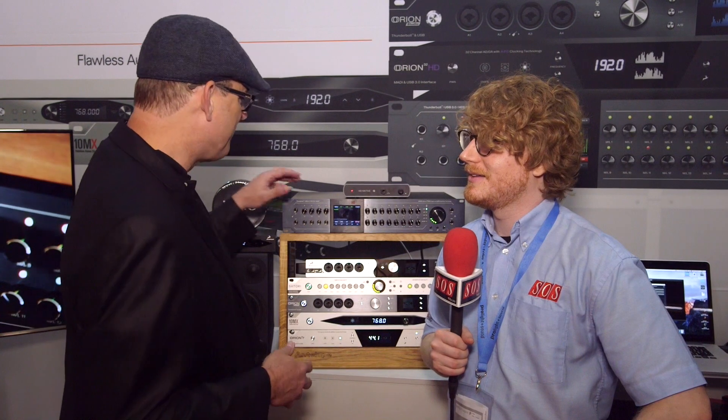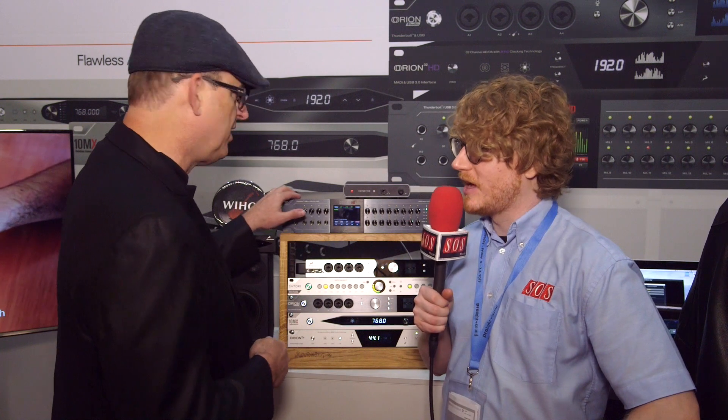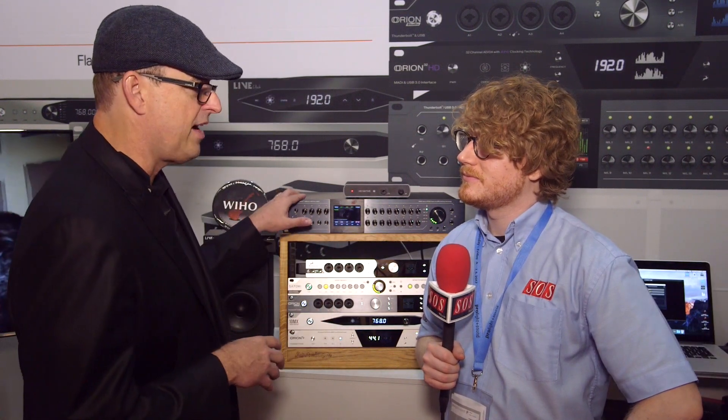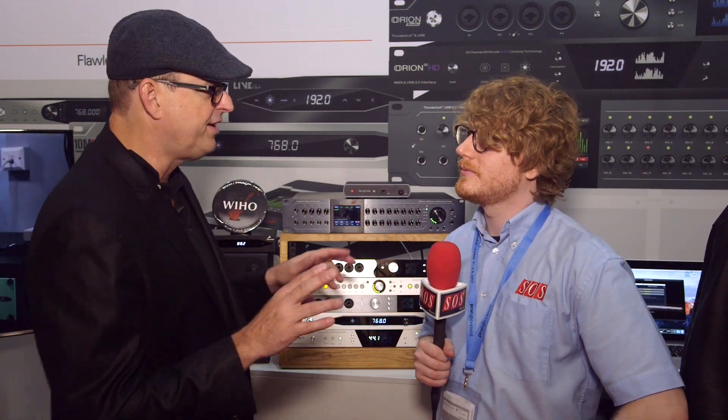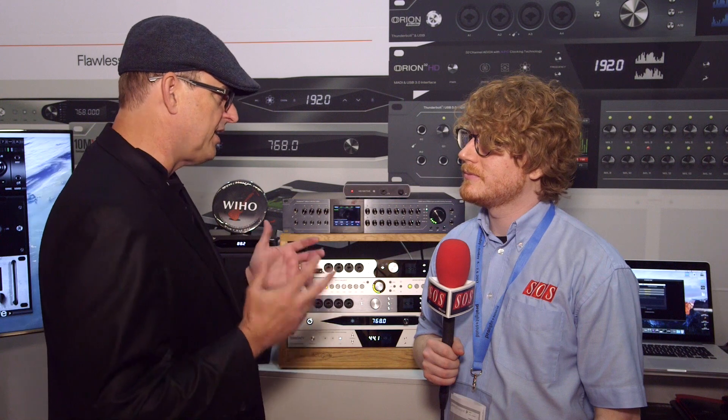The Goliath HD has brand new A to D and D to A technology. You get 124 dBs of dynamic range — the same as I mentioned on our new Orion Studio 2017 edition. We also have excellent brand new ESS chips on the D to A, and the monitor outs go up to 132 dBs on playback because we do a single chip for each side and noise averaging to raise that spec even higher. This thing is off the charts in its measurements, so the sonics are going to be exceptional.